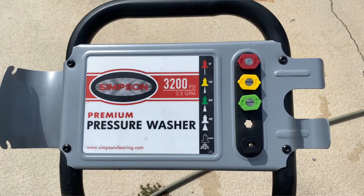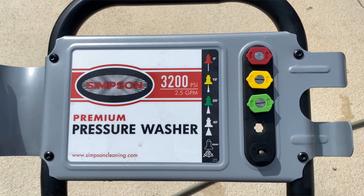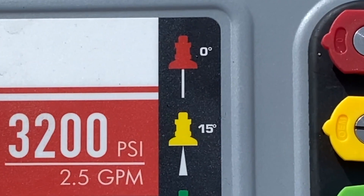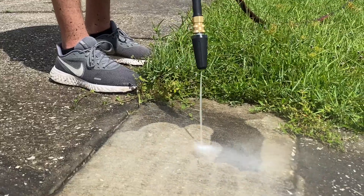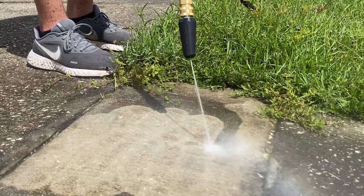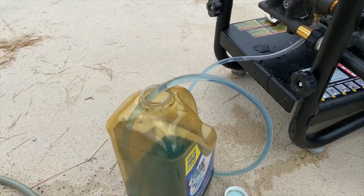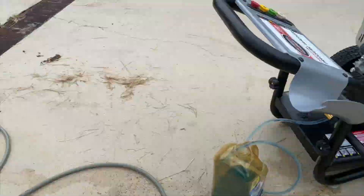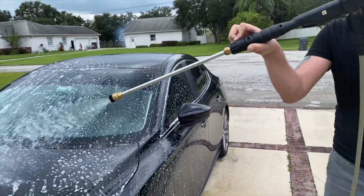The four nozzles with various degree markings and colors shoot out water in a triangle pattern that matches the label. So when you see zero degree, 25 degree, etc., that's describing the spray pattern. Turbo nozzles use a rapid circular spinning motion that makes a zero degree nozzle cover like a 25 degree. These five are the ones that take care of removing buildup. The soap nozzle mixes with soap or other detergents to put a coating of suds on whatever you're cleaning — it's not actually designed to remove gunk on its own.